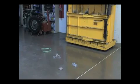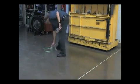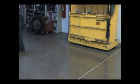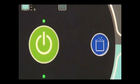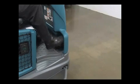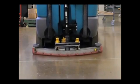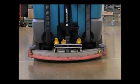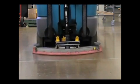Cleaning with your machine. Before scrubbing with your machine, manually pick up oversized debris, wire, string, twine or any other debris that could become wrapped around or tangled in the brushes. Press the one-step scrub button to start scrubbing. If necessary, set the scrub mode and settings for the area being cleaned, then press the propel pedal to begin scrubbing. For safety, drive slowly on inclines and slippery surfaces. When operating in reverse, the rear squeegee will raise to prevent damaging the squeegee. When traveling in forward again, all scrubbing systems will turn back on.